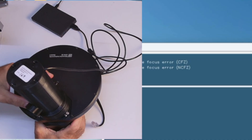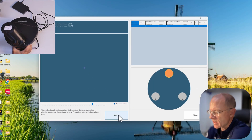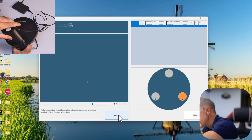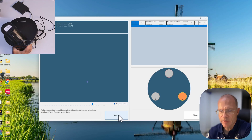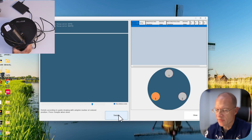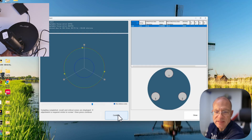Looking at the camera, I label one screw as number one, the next as two, and the third as three. There's an indicator on the device — I rotate it to screw one, make sure it's tight on the camera, and press 'sample.' Once sampling is done, it tells me to go to screw two. I rotate the indicator to screw two, ensure it's firm, press sample again. Then on to screw three — same process. After all three are sampled, we can now see the huge tilt we have: the red circle is about the same size as the green circle, which completely messes up focus.